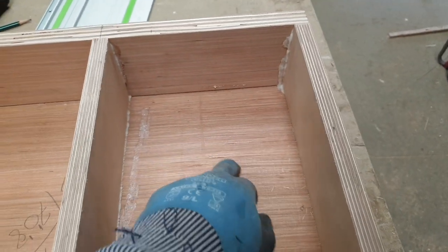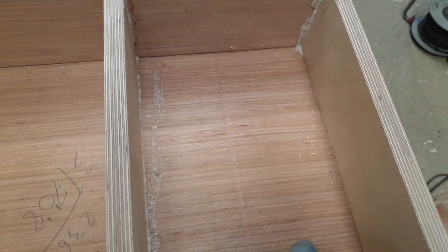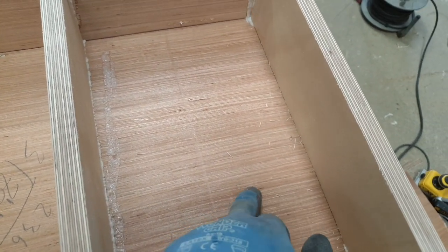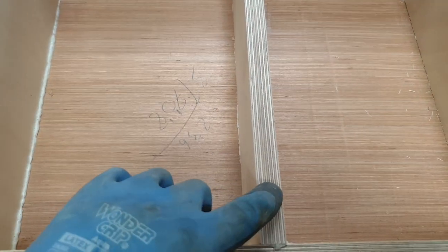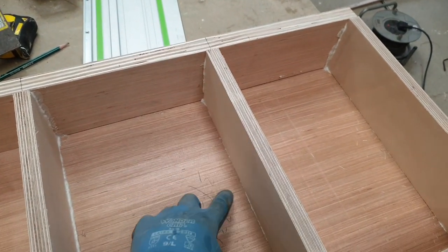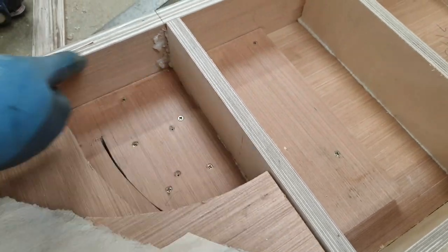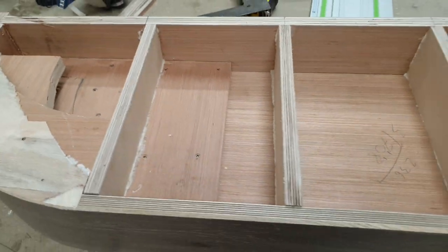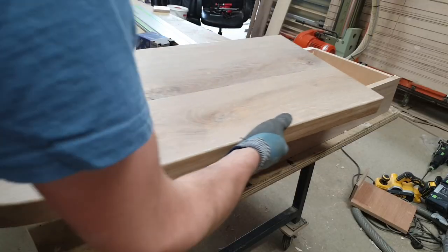so there'll be lots of dobs of glue underneath this step where that 5 mil cavity is, especially under these rails here, to transfer that load from the step through these rails so that we don't get any bounce or sort of box effect. Fill these holes in with some rock wool and then just glue the top on in place.